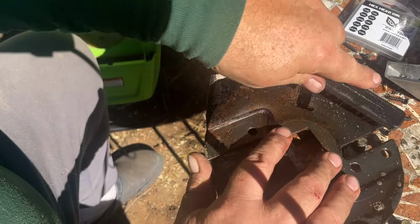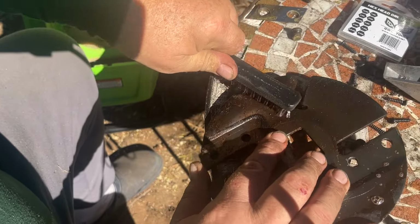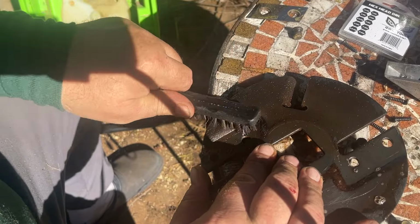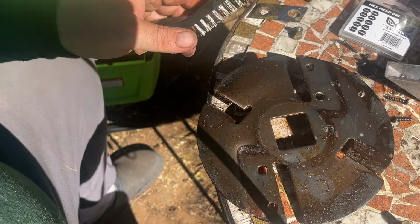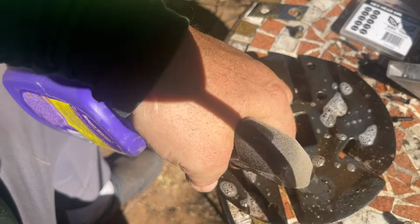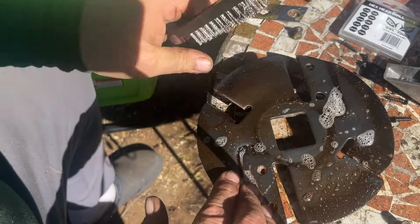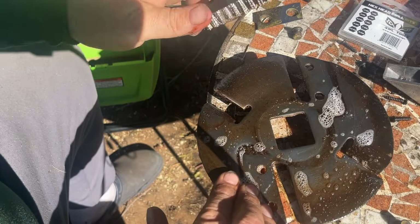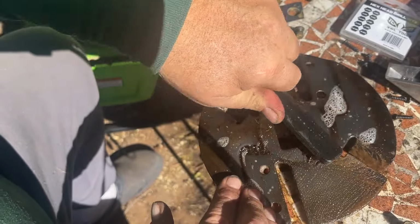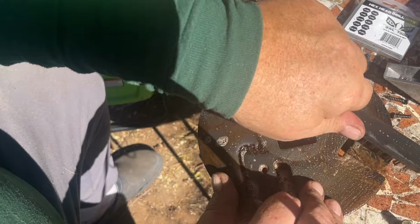A lot of times, if you have a table saw, circular saw, or even a miter saw, and you're starting to burn wood when you're cutting, and it's not cutting as good as you'd like, just clean the resin off the blade, and a lot of times that's really all your blade needs. More than likely, that's all this really needs, is to be cleaned up. But we'll flip them around and we'll see how it goes. They're still cutting, but I've noticed there's more shredding than chipping.